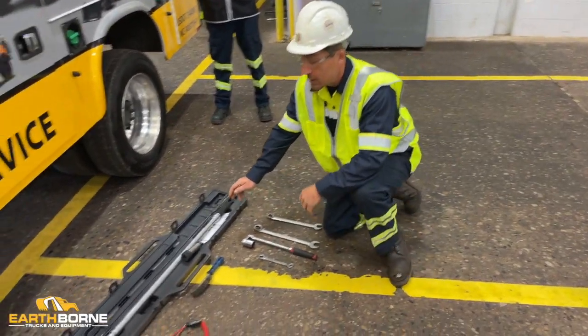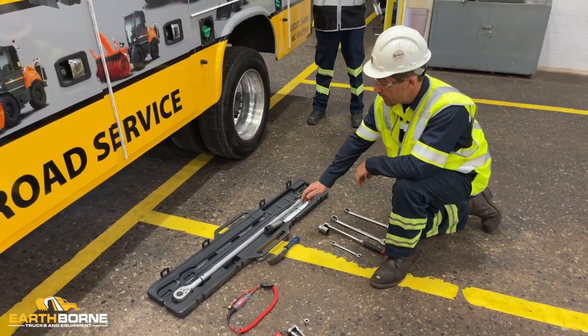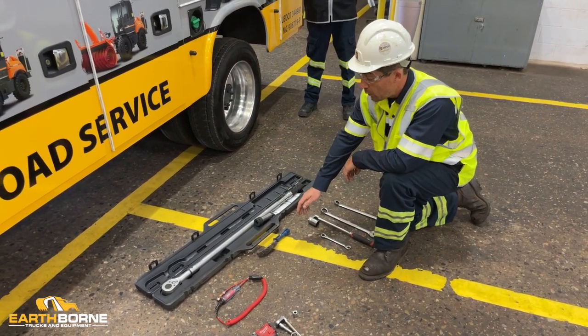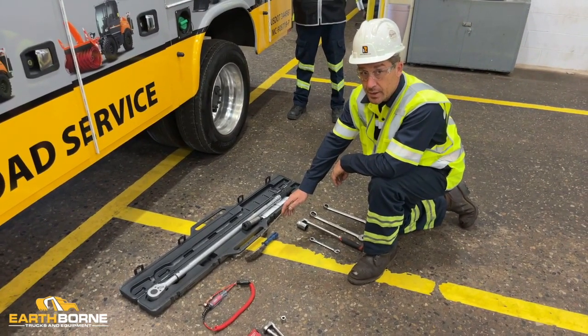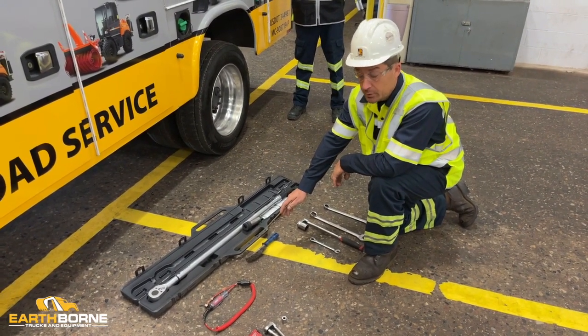You're going to want a torque wrench that goes to at least 220 foot-pounds with a 15/16 socket to install and remove your teeth. You're going to need a wire brush when installing new teeth to clean the faces of the teeth if you were flipping them, and the tooth holder itself so they seat properly.